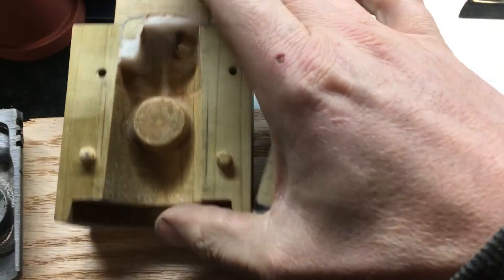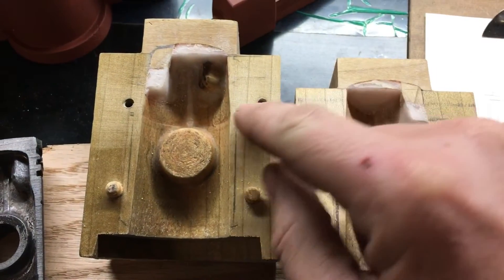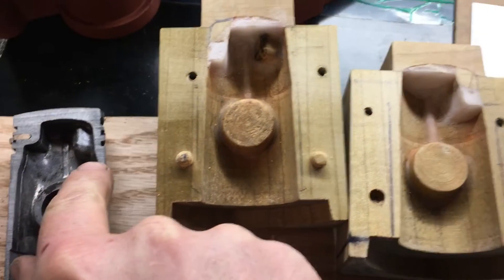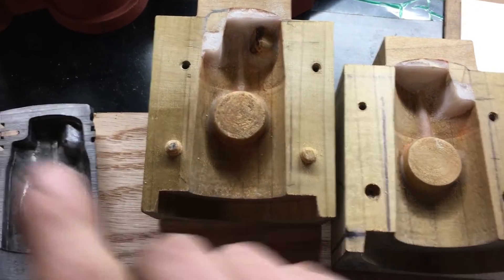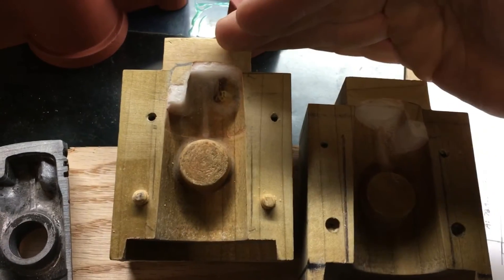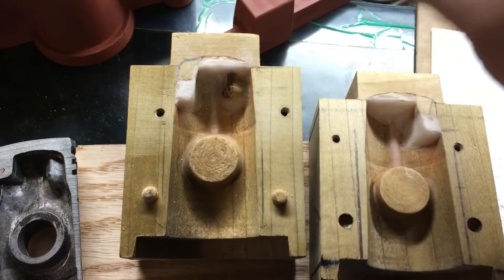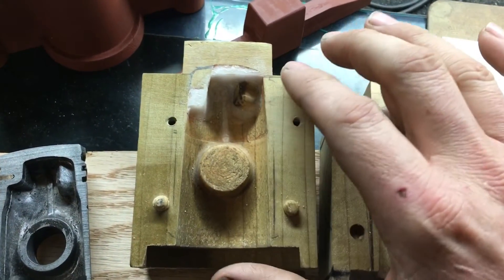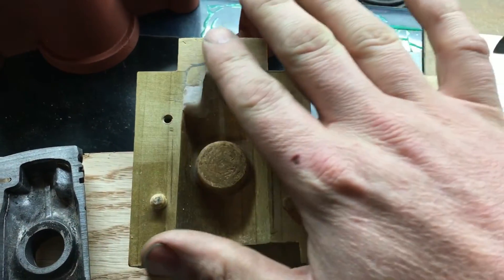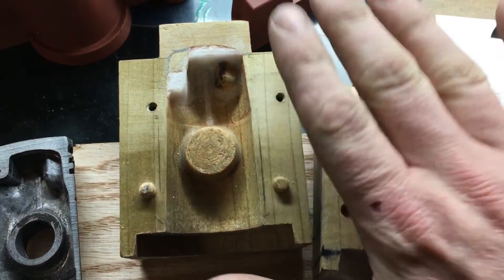Here's what I came up with. These were first bored all the way through to the smallest diameter on my metal lathe — tapered, as you can see, a gradual taper — and in this piston you can see that another taper starts. Following the measurements, I did that all the way through. Then I capped it and built this up with baking soda and super glue — amazing, because it's so forgiving. While it's still kind of soft you can carve it really easily with a Dremel tool, put the pieces together, pull them apart. I've probably got 10 hours in just these inner molds.